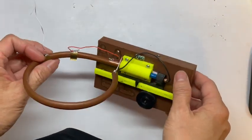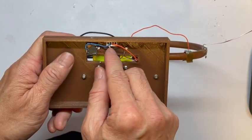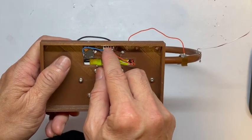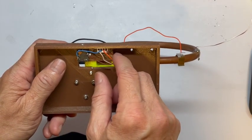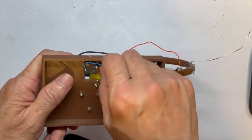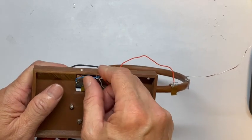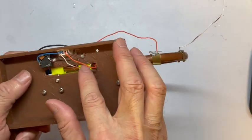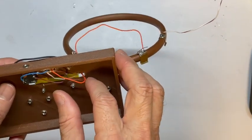So let me talk about the wiring in more detail. At the back of it, you see the four-pin socket. From the left to the right, it is gate number 2, the drain, the source, and then gate number 1. For the drain, it is for output — we connect it to one of the terminals of the headphone jack. For gate number 1, I use it for ground, so we connect it to the other end of the headphone jack. And in between the two terminals of the headphone jack, we connect a 100 pF capacitor in parallel, so we can filter out the high frequency radio wave and it will make it much clearer. The higher frequency energy will be channeled back to the resonance coil to make the tuning more stable and better.